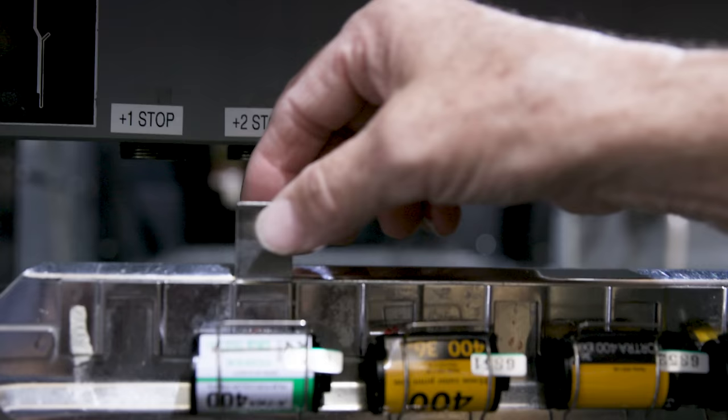Yeah. So the dip and dunk concept is really that nothing touches the film at any time, and it's just dropping down. The weights are on the bottom of the film, and it's just sitting in the chemistry. The agitation is happening by bubbles. There's nitrogen in the developer and there's air in all the secondary chemistry.